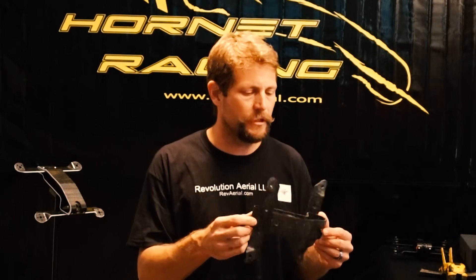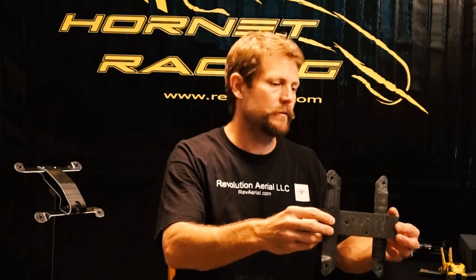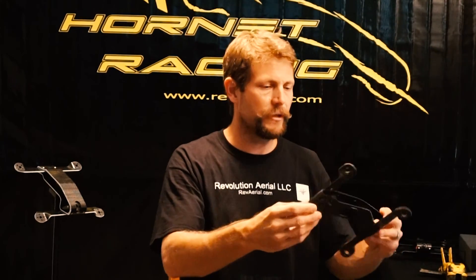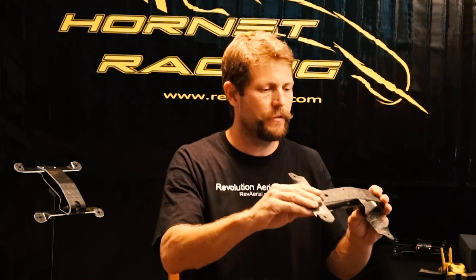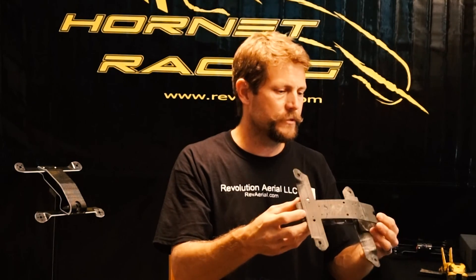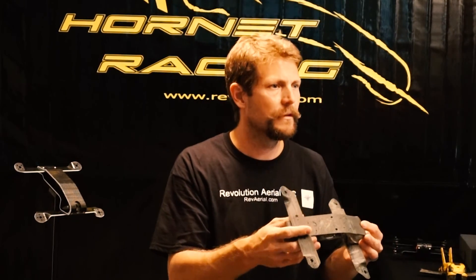We're in 2A, which is this machine. If you really had it close, you could see there's really just awful fit and finish. I wrapped it by hand and then kind of made the location of all the holes with a Dremel tool — just carved it out by hand to prove the concept, to prove that this could be a viable machine. It turns out that because it was so thin, it was really not torsionally stiff, and I needed to add a whole bunch of other hardware, which really kind of offset the effect of all the light weightness.